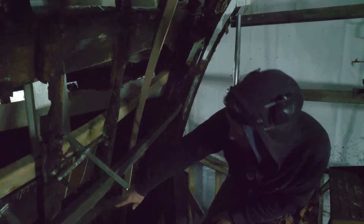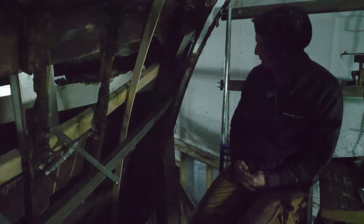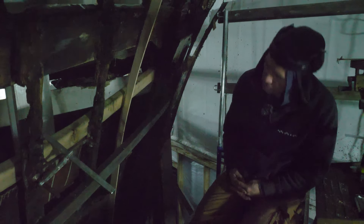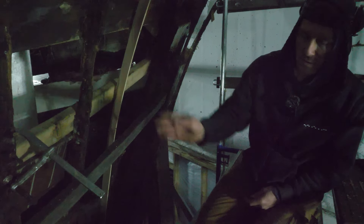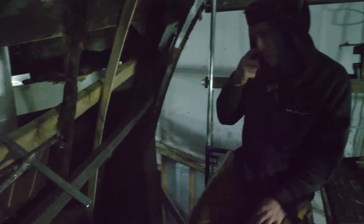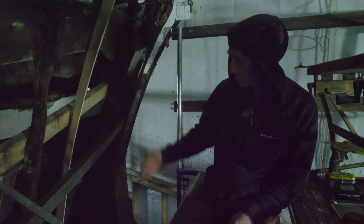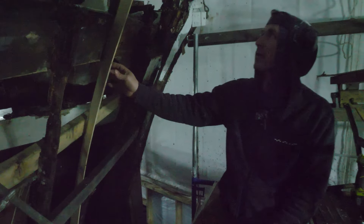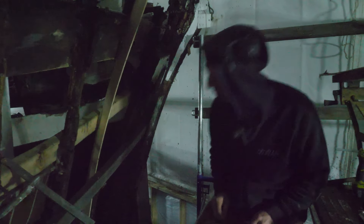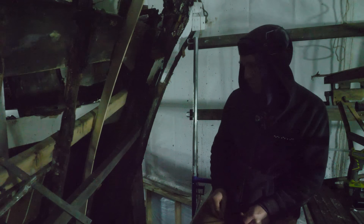I think I need to remove a little last bit of ceiling here, and there's a small bulkhead that separated the chain locker from the rest of the boat. I need to get that bit of ceiling out and that small bulkhead. I've got to pull some fasteners out of the inside of the frame so there's a nice place for the batten to lay, then put a couple more battens on the inside to define the inside edge of the frame. Then I'll know whether or not I can believe this pattern I just made.